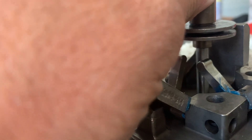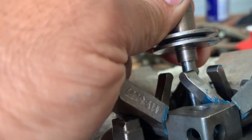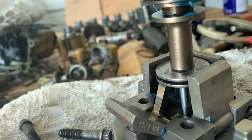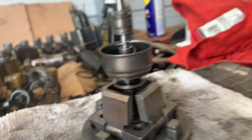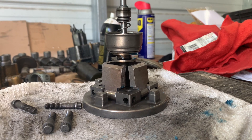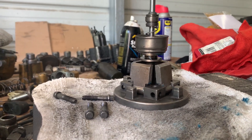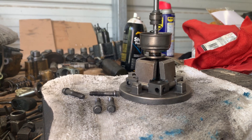If you can see - there's a clip right there, a little small wire clip, something similar to what was on the tach drive yesterday. If you have a lot of miles on a 3406 in a truck and you develop an uneven idle - what I like to call searching, hunting: idle up, idle down, all over the place - more than likely the races and flyweights are worn bad and need attention ASAP.